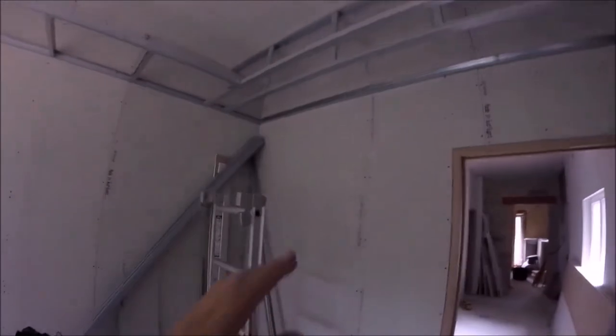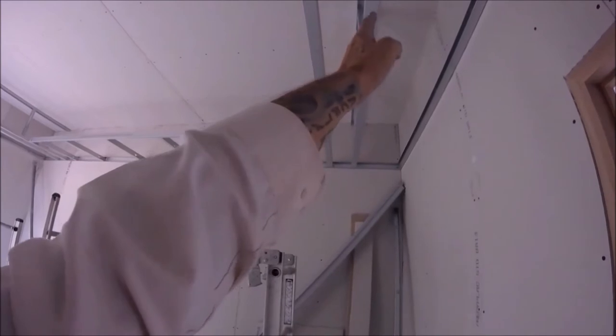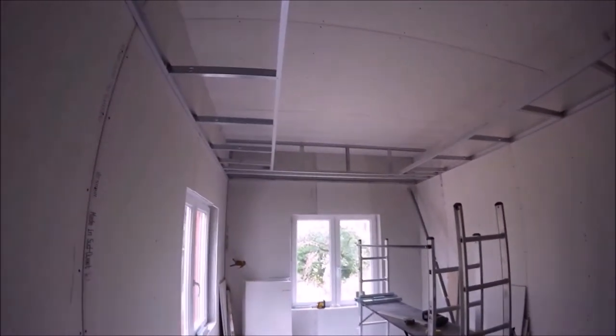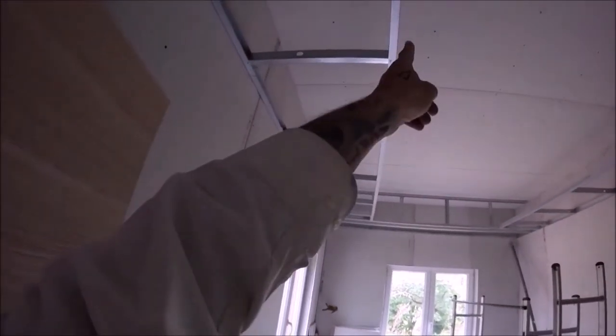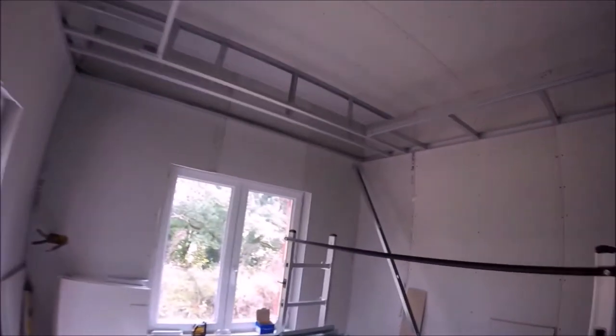Right, quick recap. So you put track either side, you put stud either side around the whole perimeter, done. Then depending on how deep you want your shelf, so like I said, it's 600 with a 200 overhang, so that's at 400. So at 400 you build a wall, you do one there and one over there, easy peasy. Then on this side and that side you build the equivalent of another stud wall. It is effectively bottom track, top track, studs. So then you connect it, easy.